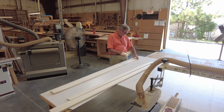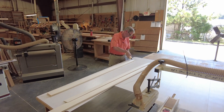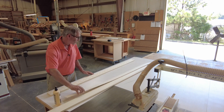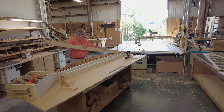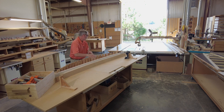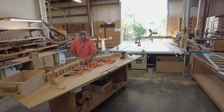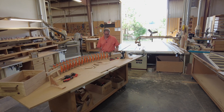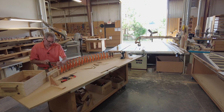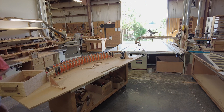The technique here is to glue together multiple layers of thin laminate material into a stack that is three quarter inches thick, like a normal jamb. Clay is carefully adding just enough glue to the top layer of the laminate stack before he adds the next and final layer. When the laminate stack is three quarter inches thick, Clay transfers it to the mold and places it between two boundary pieces. After Clay secures the laminate stack at the center, he begins adding clamps along the entire mold to form the curved jamb piece. The stack is clamped to the mold about every two to three inches to make the curve smooth and consistent. When fully clamped, he will let the glue dry for a few hours to fix the curve in place.